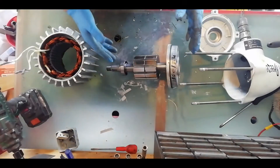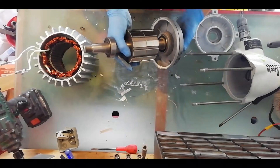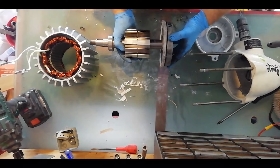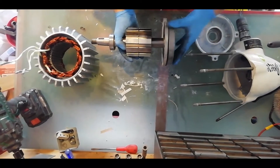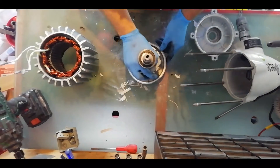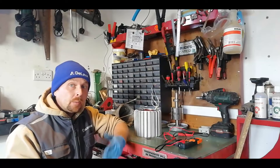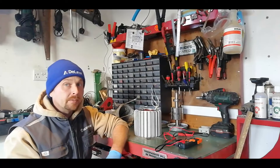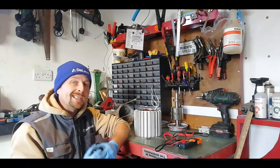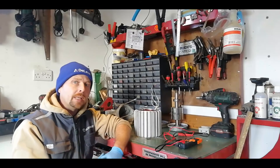With a little bit of the Arthur Franzarelli method of mechanical persuasion we have it all opened, and we can see our individual components. On the end plate here I can see that free play, that lateral movement — the bearing has failed. So what we need to do next is test the resistance value of the phases. We don't have a spec sheet on these devices and they are quite hard to find, so all we can check is that they all have the same resistance value to confirm they aren't shorted or open circuited.